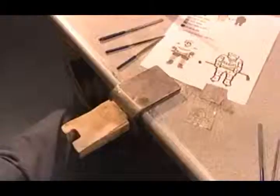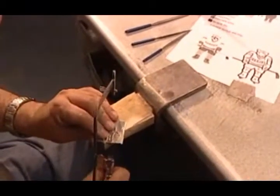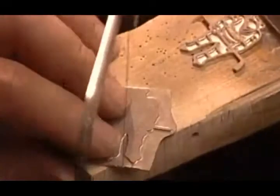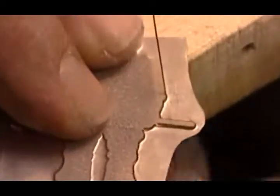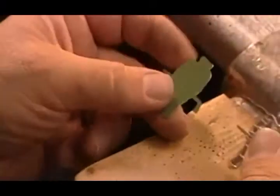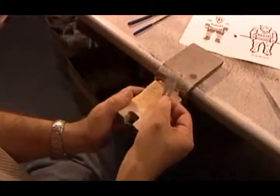This one company turns out about five million lapel pins a year. It all starts with a sketch of the pin design, and from that the master — a negative made of magnesium, a type of metal. They'll make copies of this master to create a production mold. First, using what's called a coping saw, they cut out the front and back pieces of the master. Using a dispenser about the size of a sewing needle, they glue the pieces together with epoxy.